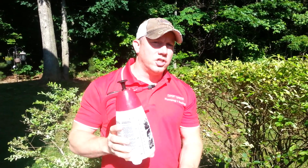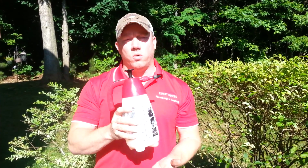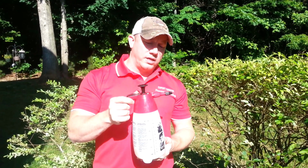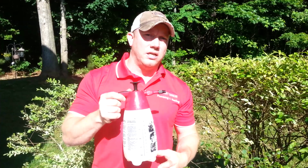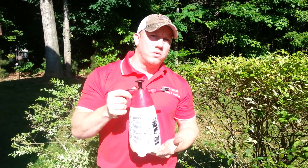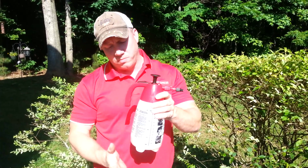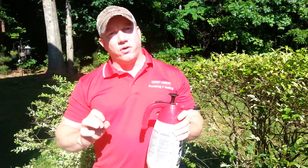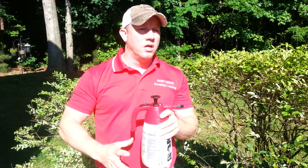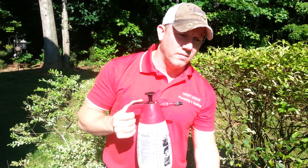Okay, so this is a coil cleaner. You cannot just use anything on your coils. Now, I use non-acid coil cleaner with a heavy degreaser. You make sure that you don't use anything too acidic, and that you also never use the coil cleaner straight. Always have a good proper mix, meaning I have a 32:1 ratio for my coil cleaner. If you have anything stronger than that, it will destroy the coils.